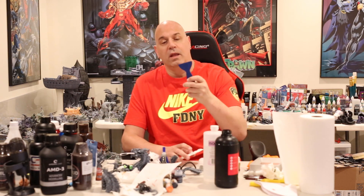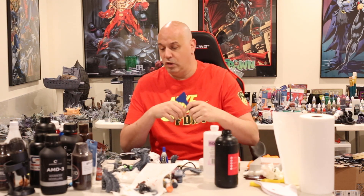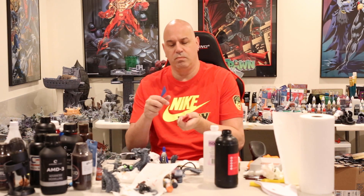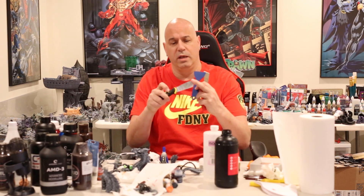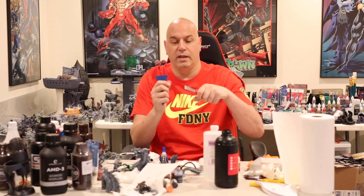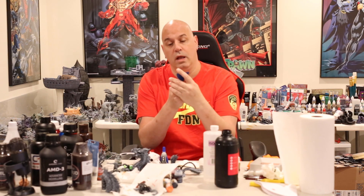Plastic scraper — I've been unboxing tons of printers and doing reviews for a long time and I always say plastic scraper or metal scraper, but what I should have been saying: this goes in the garbage. I'm not going to use it to remove prints. It's not strong enough. You should be using something with a razor edge that is metal and solid — not even the flimsy ones they give you. Those go in the garbage too. If you get a print that's really stuck on or a heavier print, I find it hard to use.